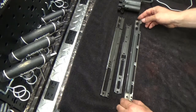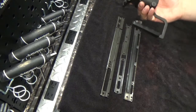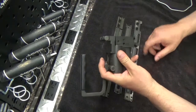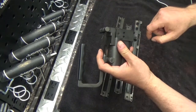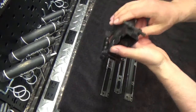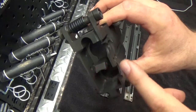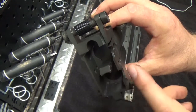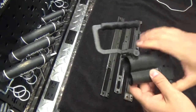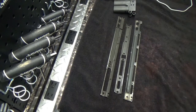Now, when the time comes to put your back half and rivet it into your trunnion, we have a Saco Defense trunnion here. There's 5 rivets that hold this together. There's 2 long rivets that go through. There's a small rivet on the left side, small rivet on the right side, small rivet on the bottom. We'll see if we can get that in the camera there. You can see where the long rivets go through that bolt, that feed ramp there, and how the top, it's just 2 short rivets. I'm going to cue in some pictures right now of a mil-spec M60 rivet set for reference.